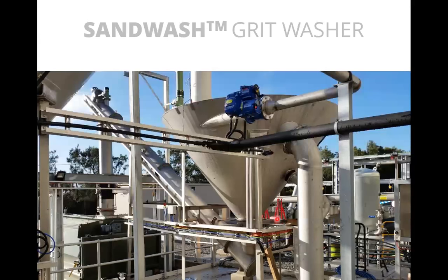And there's various controls. These are a little more sophisticated. They work on a pressure switch system or a pressure sensitive sensor down in the bottom that can detect how much sand you've got in the tank, how much water you've got in the tank, and it will put it through its various cycles according to that. So a little more sophisticated, but the driving force on that is still a time cycle interlocked with the grit pumps that are feeding it.